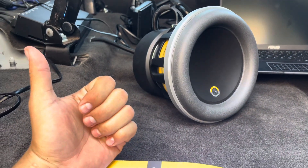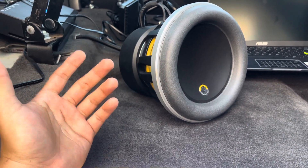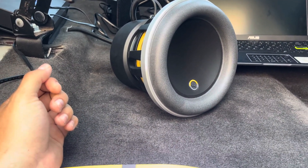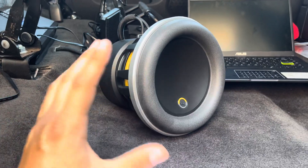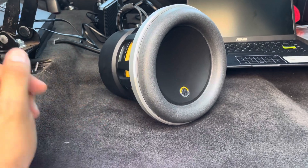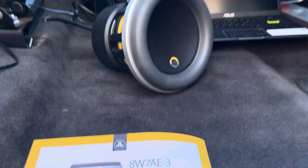These specs aren't everything though — keep that in mind. The box you put the subwoofer in matters: if it's too small or too big, the subwoofer is going to sound very poor. The amplifier you use also matters — high distortion or low-quality amplification will affect performance. It all relates to one another, but you can generally predict a subwoofer's behavior with these Thiele-Small specs.